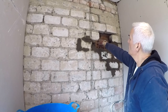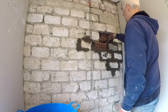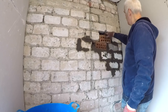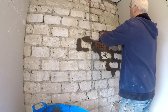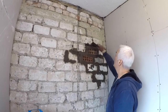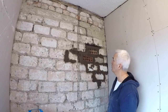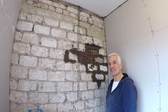I've managed to stick a little wooden wedge in there - that'll be all right once it's filled up with the mortar. Our last brick to go in - it's going to need a lot of mortar, isn't it? Well, that's going to have to do for now because that gap is too big and the mortar will just fall out. I'll have to let that dry and come back later on. It's better than that big hole in the wall - I'm quite happy with that. Right, next job.